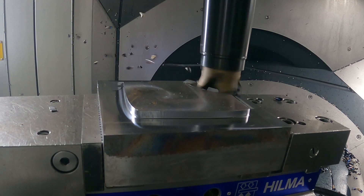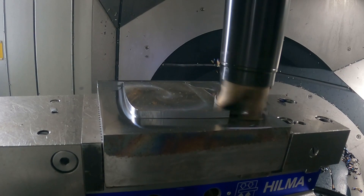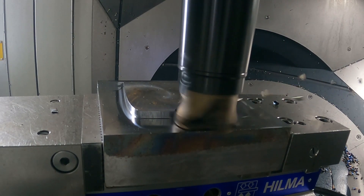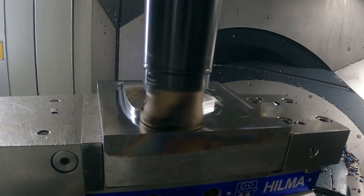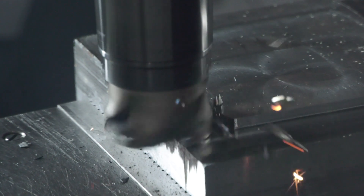So for people looking to invest in lightweight technology, what are the advantages? Productivity is a key advantage — we're able to run quicker at greater depth of cut. Surface finish as well, because when you're looking at long-overhang application areas, surface finish is vital. And also the predictability, repeatability, and security of this concept far outweighs the steel body.